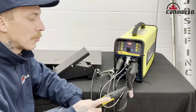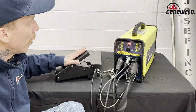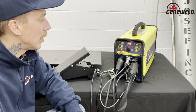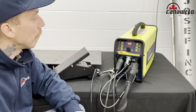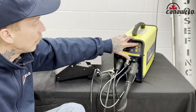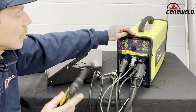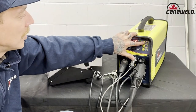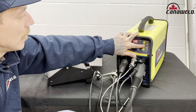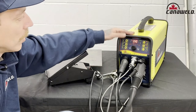Today we're going to be switching from the thumb control on our TIG torch to using this sweet little foot pedal that we got. But the first thing I'm going to have to do is change some of the values on this machine to make sure that my foot pedal runs smoothly. The first thing I want to do is switch from 4-step into 2-step. When I was using the TIG torch, I had it in 4-step mode, but that doesn't make any sense when you're using a foot pedal. I'm also going to switch into AC, not because I'm using the foot pedal, but because I'm going to be welding aluminum.